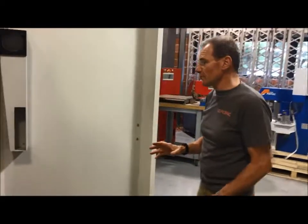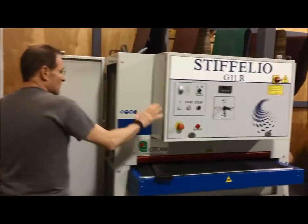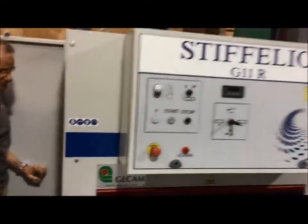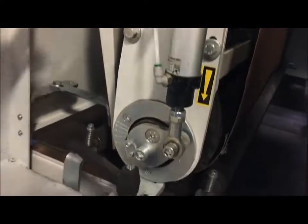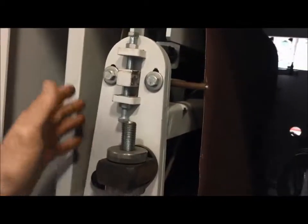Let me show you three different kinds of machines. Maybe we first go over here. So this is a very simple machine with a belt sander. And if you look in here, see this has a single head belt sander, simply. That is what you would be using for surface graining, and you would actually get a very sharp edge and maybe a secondary burr. So this is good to remove dross, but it is certainly not good to deburr something and make the edges round and safe.